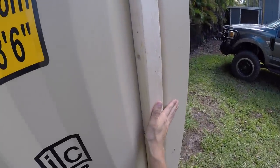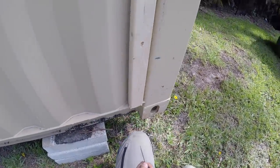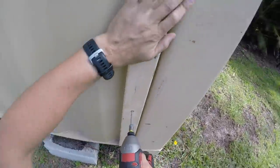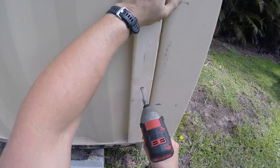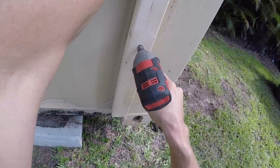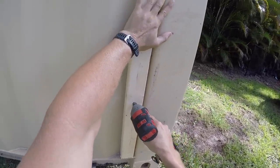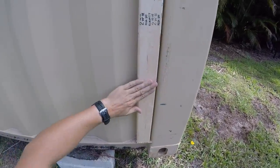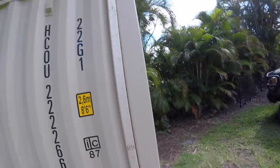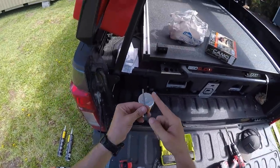You can see it's pretty flush right there. It's sticking out a little bit at the bottom because of a weld down here, so I'm going to preset the screw and lift it up just a hair — that's going to pull it back ever so slightly because now it's above that weld. Now that thing is really grabbed. You can see it's squeezing the glue out on the sides, so I know that's in there nice and tight. These self-tappers take a little while to drill themselves through.